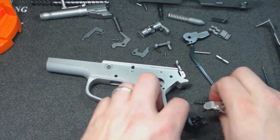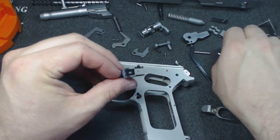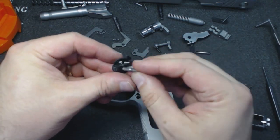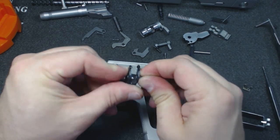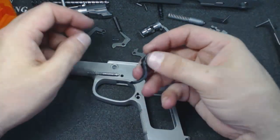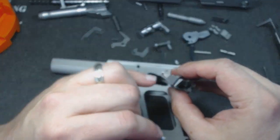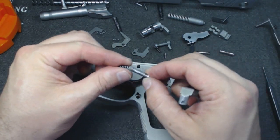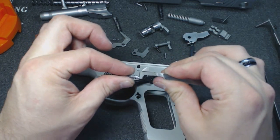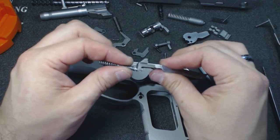So, putting all those bits together so you can see what the heck was going on in there. You had this detent in there to hold the trigger pin in place. Well, I'm not going to knock it through there, but basically that just came up in the groove so the trigger pin doesn't drift out. The crazy trigger bar has a dimple, and the spring and pin of the trigger return rides in that dimple, so that even though it's going to move through a large area of space, it doesn't lose tracking and come off to the left or right.